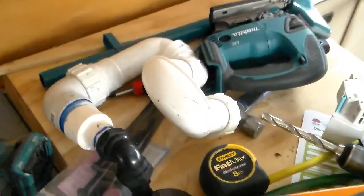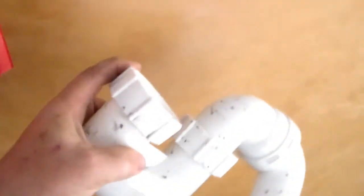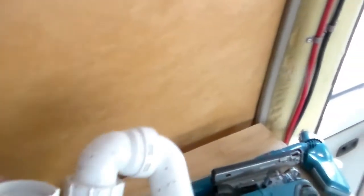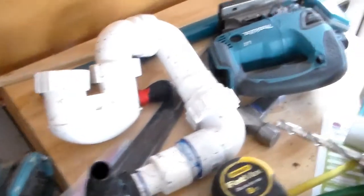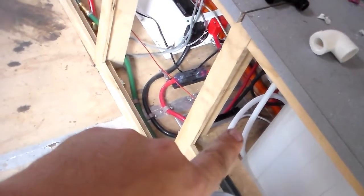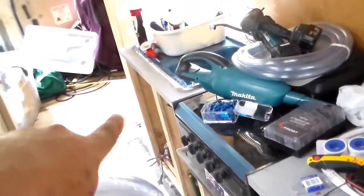So the solution I've come up with — I gave it a bit of thought. This is the pipe as it attaches to the bottom of that drain, and there's an extension that comes up through here to where the floor is, a bit of a P-trap to stop any smells back in from the grey tank. That all goes into a 25mm or 1 inch clear poly pipe, and connects up with the drainage from the sink under the floor, and from the washing machine, and goes back to the grey tank.